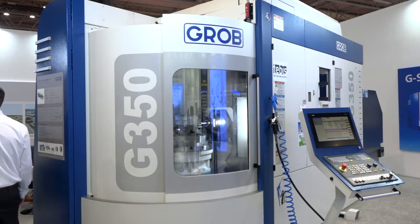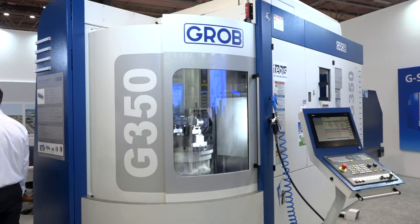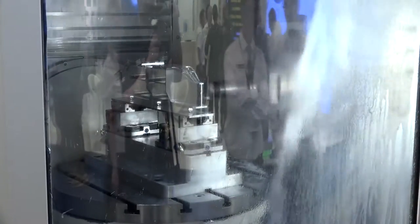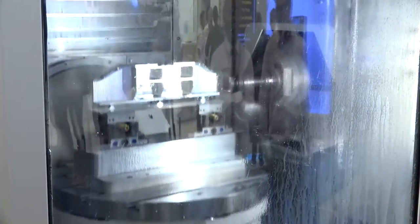Looking at this machine — it's full simultaneous but the spindle is on the side. Why is this? It's a horizontal spindle — very rigid, the spindle never comes off its rails, it's on its own axes. For swarf evacuation we use gravity: gravity is our friend, swarf falls straight down into the chip conveyor and away.